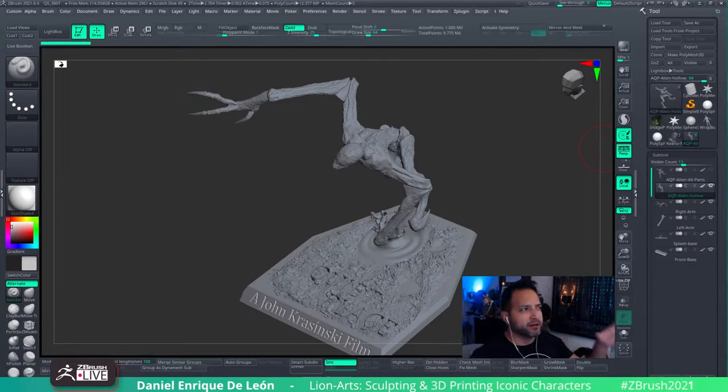And there's an even better version of that now, which I'll be printing other pieces with, called Tough 2000. I think that refers to the tensile strength. They have Tough 2000, Tough 1500, and below that, tiers of strength and rigidity. Below that you have Gray Pro, and above Tough 2000 you get much more rigid, but it also becomes more brittle. You have less flexion in it, and that's Rigid 10K.